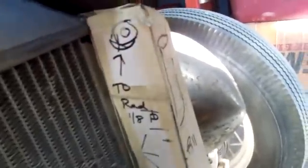I've got some mounting bungs here — I'm going to weld some 3/8 square aluminum with a quarter-inch hole drilled and tapped in them so I can screw it onto the holes in the side of the grill shell. Over here I've marked where I've got to put a fitting to go from the radiator down to here. It'll have a drain out the bottom — a little tube that goes almost all the way up so it only drains if it gets overfull. I made the whole thing and then figured out how I want to cut it apart.